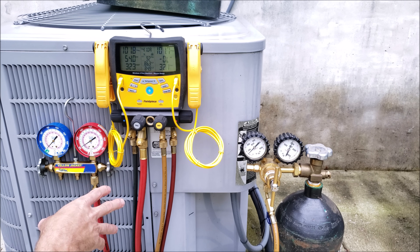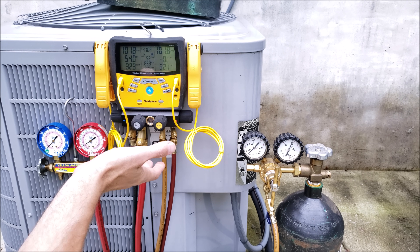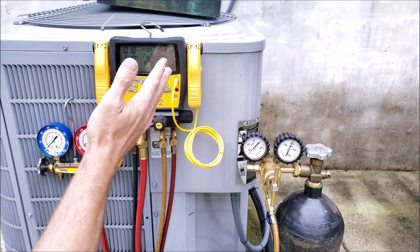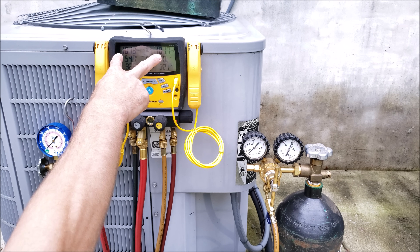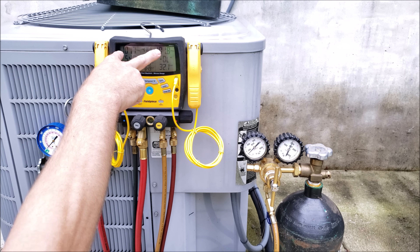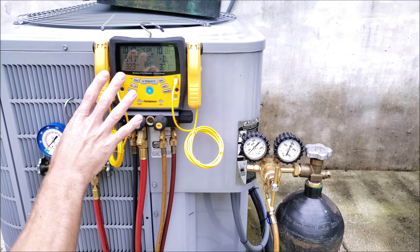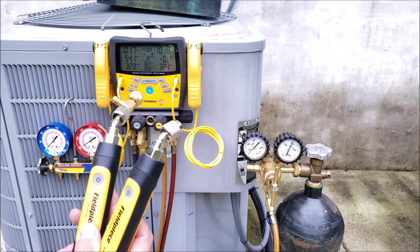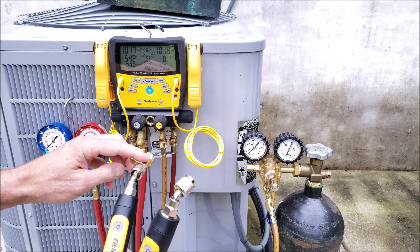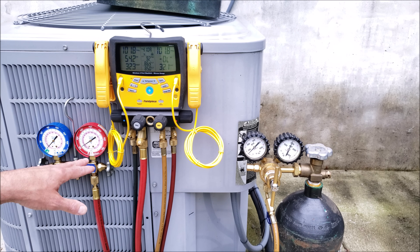Keep your hoses to a minimum, but do pressure test on both sides of the system. If you have a high-pressure test, it may not equalize on both sides — the TXV may be restricting pressure and closing. For most systems you can get both sides to match; add your nitrogen into both sides at the same time to equalize pressures. To reduce the possibility of leaking through hoses, you could use test probes with a T fitting so you can read pressure while also adding nitrogen. You'd need a T for both sides, but it helps avoid potential leaks from hoses and manifold gauge sets.